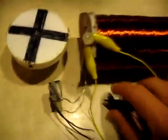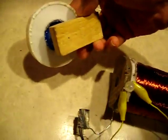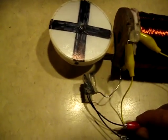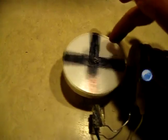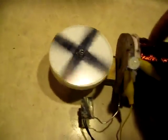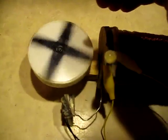What I've designed for my coil is this little rotating magnetic wheel here. It's a bearing on a spindle, and I've got four magnets on it, and a reed switch. When the reed switch closes, it actually turns the primary core of this coil and the soft iron core into an electromagnet. That electromagnet pushes the wheel around to the next position. It just takes off and spins up faster and faster, pulsing the magnetic field through the secondary coil and generating the light and current you see here in the LED.